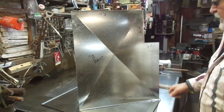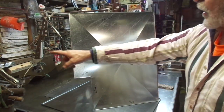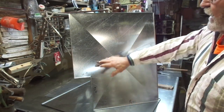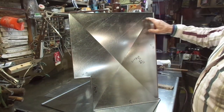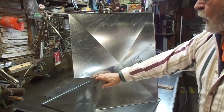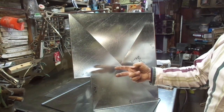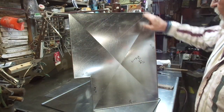Let me turn it over — that makes a little more sense. This is the horizontal furnace hanging up in the attic; it's going to attach on this. We'll cut the bottom out for the return air grill to come up through the ceiling. We have to make one piece wrapper all the way around this edge: one inch, 22 inch width, 27 inches in height, 17 and seven eighths inch in width, nine and a quarter inches in height, four inch throat, one inch flange. Add all that together and we come up with 82 and an eighth by the width, which is 21 plus two inches for the two Pittsburghs — so 23. Cut size is 82 and one eighth by 23 for that wrapper.